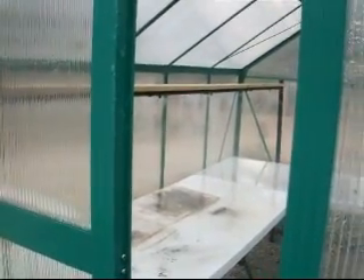As you can see, you can see in there — I actually won't go in fully — but you can see that the sprayers are working beautifully against the vents there. The only problem is that the sprayers I bought were incorrectly labelled. These ones are actually quite a fine jet that sprays out probably about 2 metres under the pressure. So the little sprayer in here is spraying out and hitting this table over here, giving the wrong effect. The trick will be just to duck into a hardware store and pick up some new sprayers — they're very, very cheap. Those ones will just screw out and I'll screw new ones in.